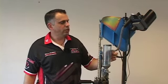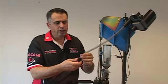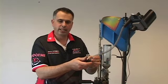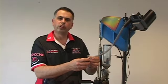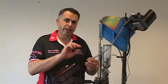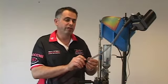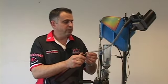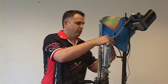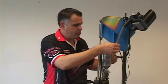One quick and easy solution is to simply remove the cap. You can screw the spring out here, counterclockwise, to remove it, and then shorten the spring. Just use a wire cutter and cut perhaps an inch off. Don't take too much off because you don't want the spring to be too tight. Cut it just a little bit, make sure the edge is clean so you're not getting anything that can catch on the bullets, and then screw it back in. Take off perhaps half an inch and try it, take off another half an inch and see how that goes. And then once back into position, you just want to make sure that when the tool head is in the up position, you're not getting that pooling effect of the bullets pooling in the spring.